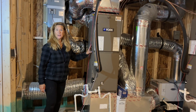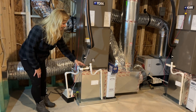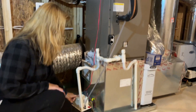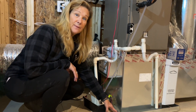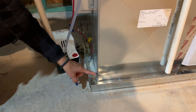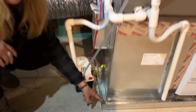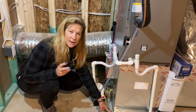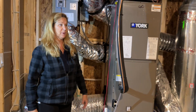While we're down here looking at the air filters, another thing to keep in mind is your condensation line should be going up and out of the house. If you have water in the system, that's something you should take care of right away. If your condensate is backing up into your pan, make sure that gets taken out — just get a shop vac, suck it out, and clean it up.